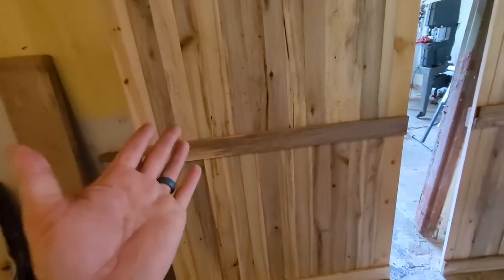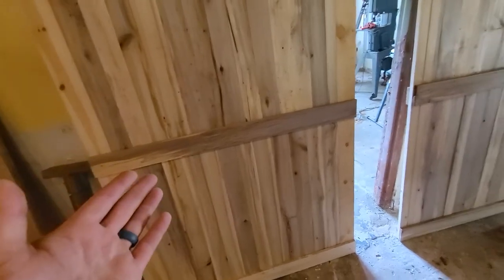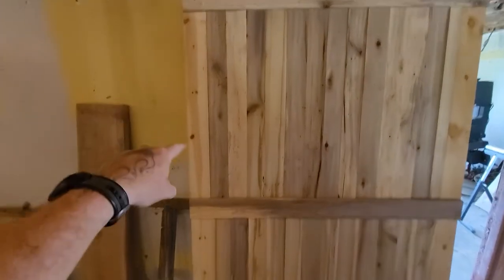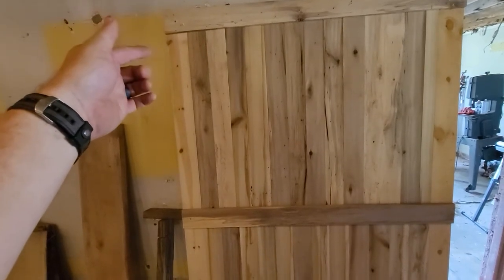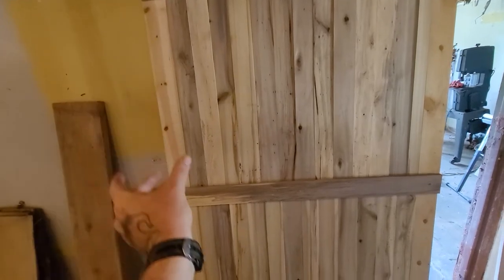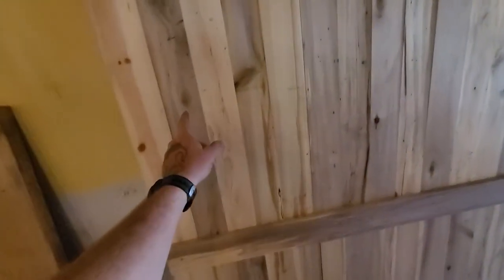The reason we did that is because all of our stuff — the sweet gum and the hickory — wasn't quite straight enough. These doors are almost seven full feet in height, and we would have been wasting a lot of wood because it was bowed. The store-bought pine boards were straighter, that's why we used them for the outside edge.